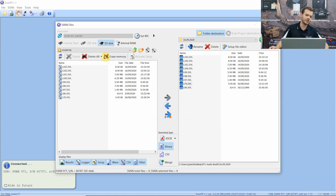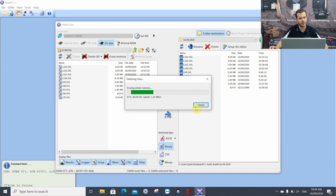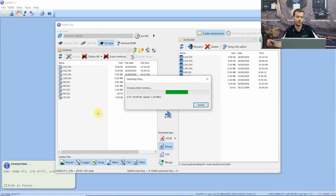All the files have been downloaded - press OK. If you want to stay on top of the data inside the instrument, just hit Erase Memory on the left-hand side and press OK. That's going to erase all the data - you can also do that on the instrument itself. Once that's all deleted we're going to open up one of these files saved in our desktop directory and do some basic analysis: put it into a table format, export it to Excel with some header info, so you're ready to put that straight into your reports.